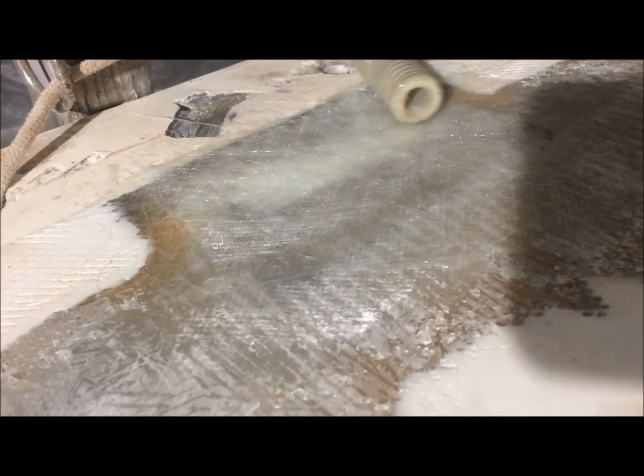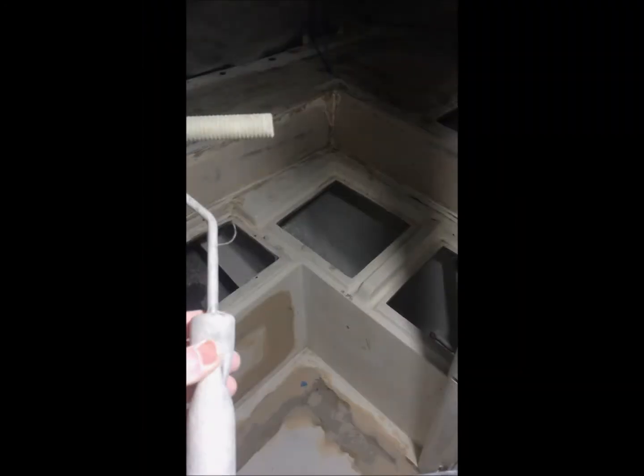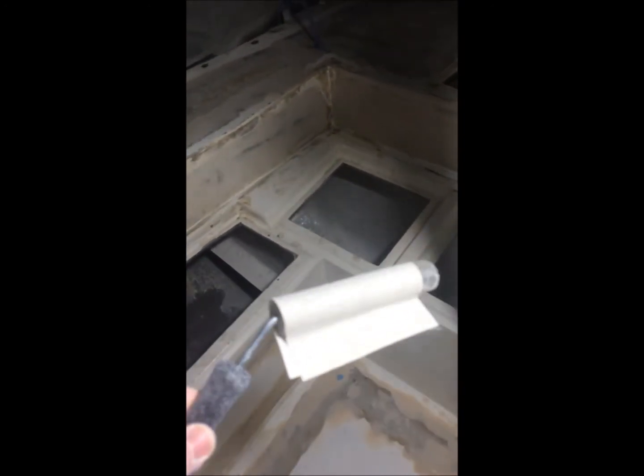The plan for the coach roof to deck seam was to dig out the old silicone sealant and then lay in a 1.5 inch wide strip of chop strand mat with thickened epoxy and make a fillet between the coach roof and the deck. It sounds simple enough, but getting the CSM to bend and stay put was a challenge. Once cured, I converted a fiberglass roller by cutting off the roller end and epoxying in place a piece of PVC tubing, applying a little adhesive-backed sandpaper — and voila, the perfect tool for fairing the epoxy in the joint.